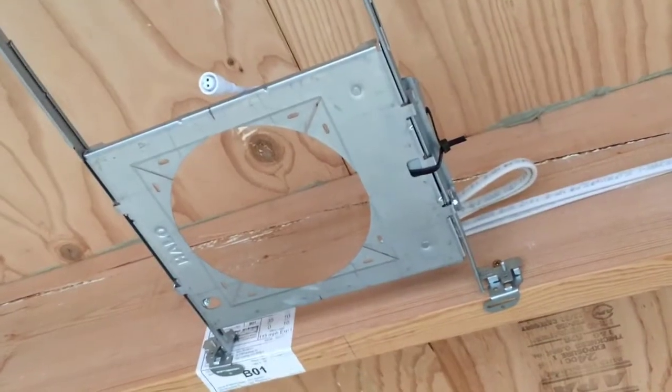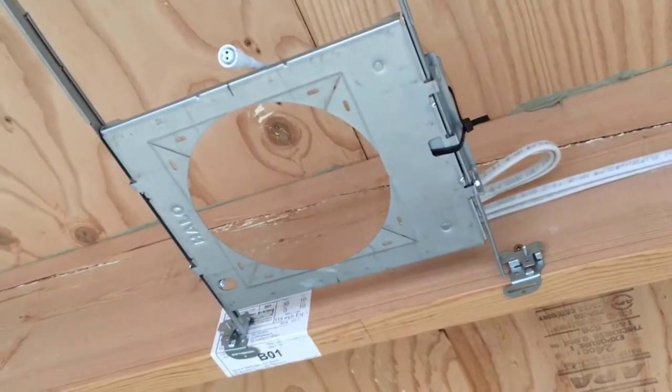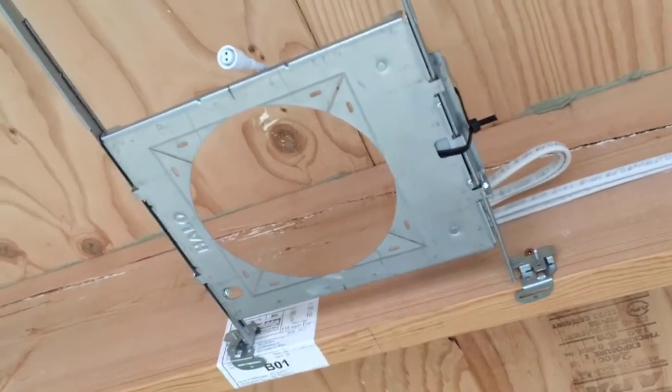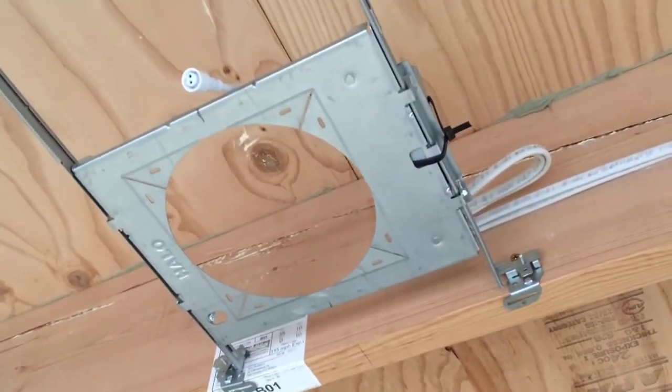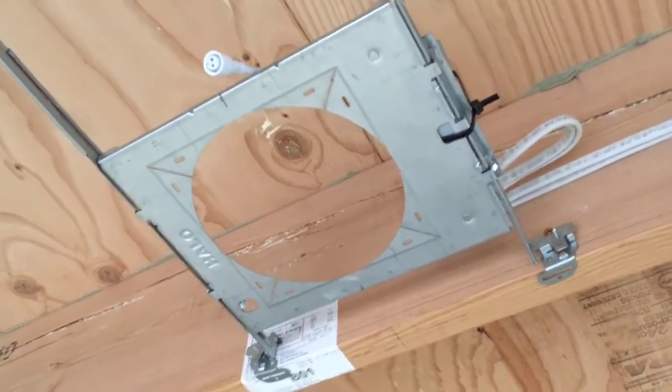To show a few details of how we installed these: we had some six-inch lights, so we laid out the lights on the floor and then lasered up to these brackets. We built a little insert into the hole so we could always mark the center, using these six-inch halo inserts mainly so we get the lights all laid out and get our drywall cut accurately.